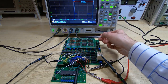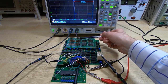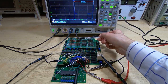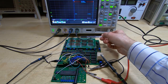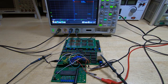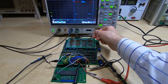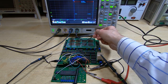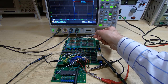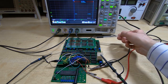And on top of that we have the issue that there is a lot of cross-coupling between the various wires, and the effect that will have will vary depending on the actual bit pattern that's been applied. We then have an even bigger complication: all the X wires go through every single mat. So all the X0 wires, or rather the X0 wire, goes through all the X0 cores.